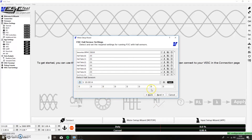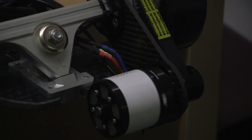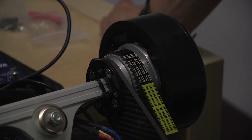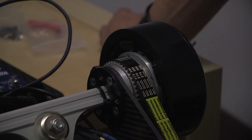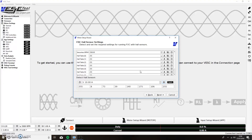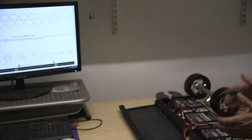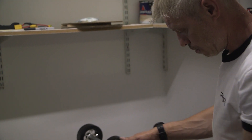Press next. Now we'll play the settings we've just got — the motor will tick forward and backwards across the halls. You should see it working slowly. At the bottom you'll see all the parameters of the table coming up, which means it's good. Apply these, press next, and finish. That is the VESC system set up for the motors.